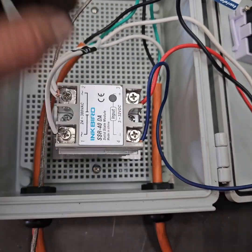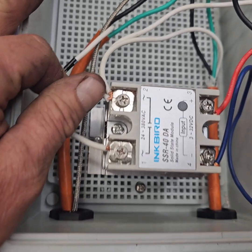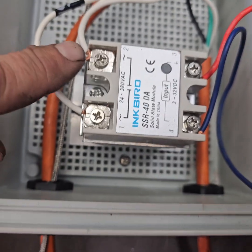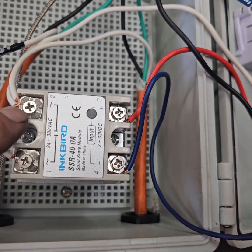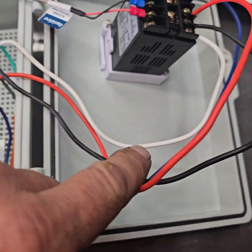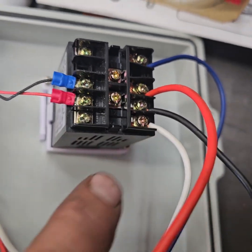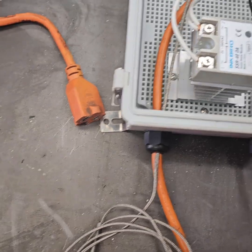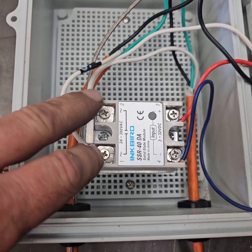Then your white, or neutral, or common comes in and connects over here to the number two space on your relay. So this is the line that comes in, goes to number two. Then another common connects and goes over here to give a common to your controller, and it goes to this screw here. The cord that comes out to the plug-in — the common on it hooks to number two, and the switch inside connects these two together. This is what makes it go on and off.